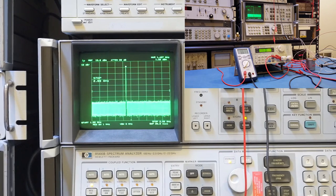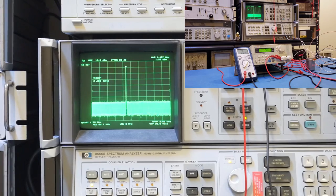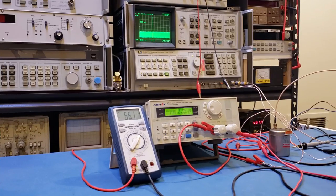Taking a peak measurement, we're sitting at 1.437 gigahertz at a coil current of 66 milliamps — significantly lower than the 2.7 gigahertz specified minimum frequency tuning range. So now you have an idea of how the YIG oscillator works, with a demonstration of both the main tuning coil and the FM coil. I hope you enjoyed the video and learned something new. If you liked it, please give it a thumbs up, remember to subscribe and share, and I'll catch you next time.